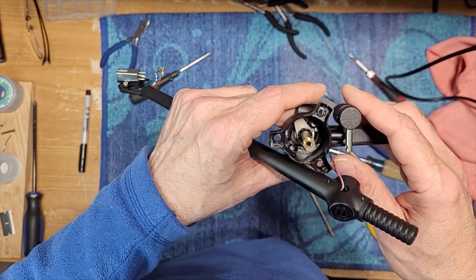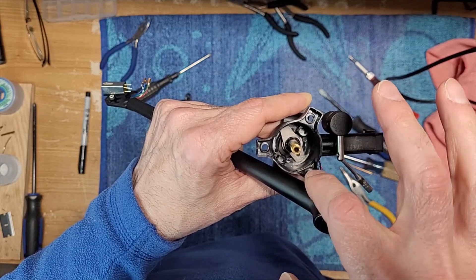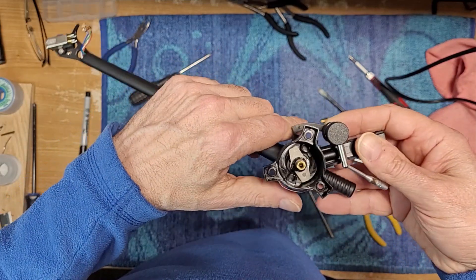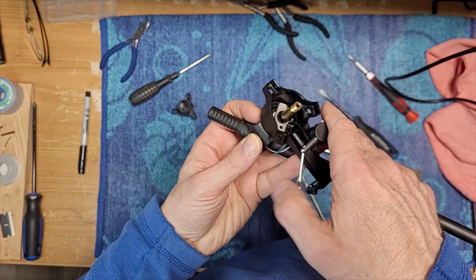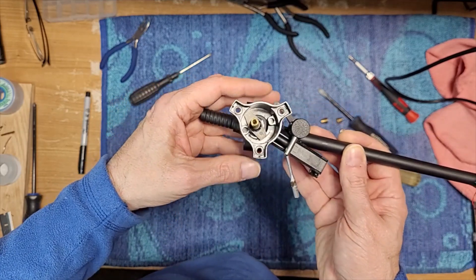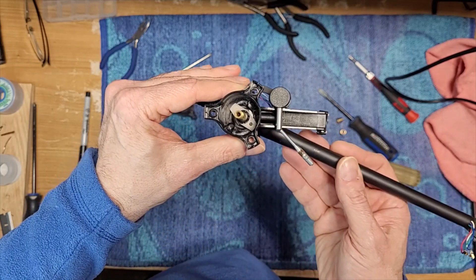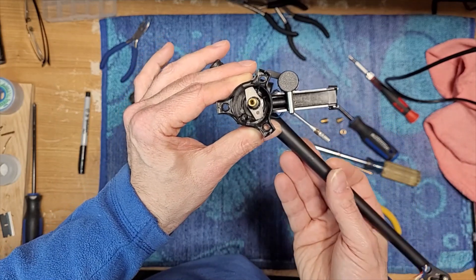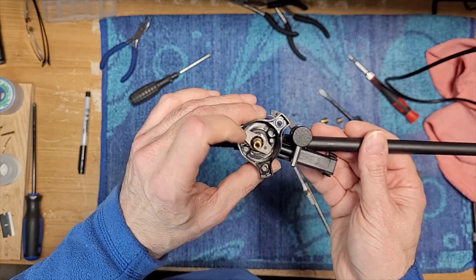Here's an update. This little plate here that's inside — that kind of rhombus-shaped aluminum plate with that black dot — it looks like it was moved out of position. If we straighten out and put this arm where it would be if it normally played, when she reefed on it she moved that plate where it was touching one of those two bolt holes there. So if I turn this now, I am getting that movement. So can this be repaired just by moving this plate? Because that's what I think has happened.